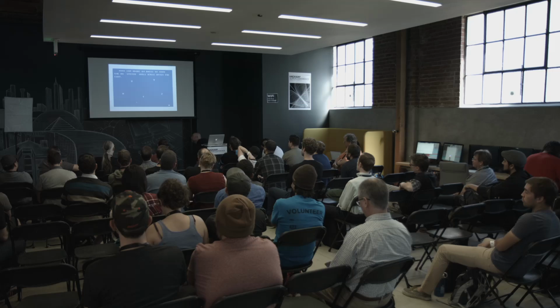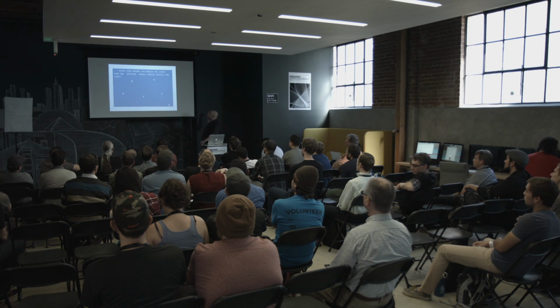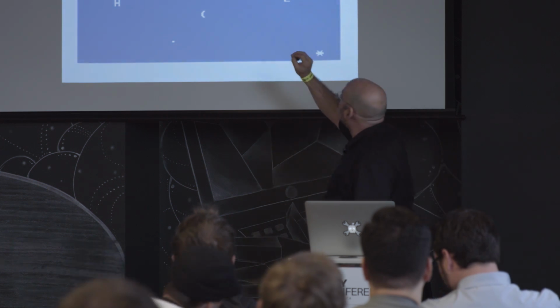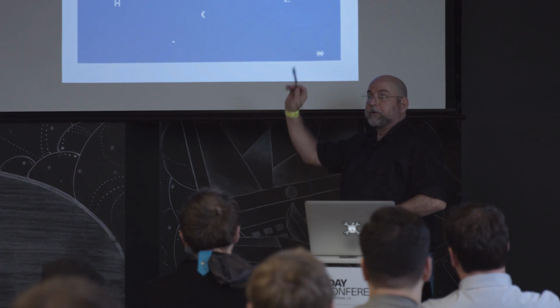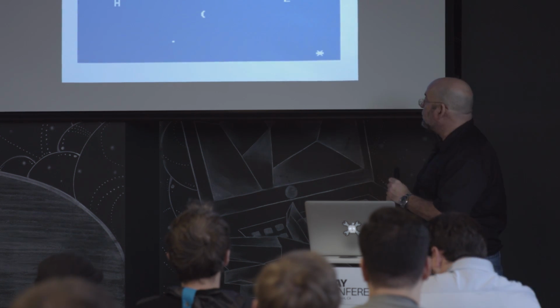One of the things I noticed was that there would be an @ sign at that one spot, most often, not every time. And so what we're doing is we're using the video display as a logic analyzer. The processor doesn't come along for another 100 milliseconds and trip over the bad memory, but within 1 scan time of that @ sign getting there, we knew it. So I took a light pen. I circled where it should be. Actually, I took this 30-year-old light pen. I held this light pen up against that, triggered an analyzer that triggered another one, and it saw the corruption well before the processor. So it's the first time we'd used one of these to fix something.